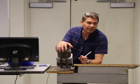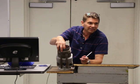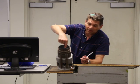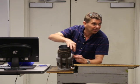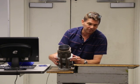When measuring a cylinder, each manufacturer tells you to measure a little differently. I'm giving you a Continental cylinder with the Continental instructions. Normally I measure for out-of-round: measure here, then here, then here, then here — take the difference, that's your out-of-round. Then I measure all the way down at the bottom — which is really the top when it's facing this way.